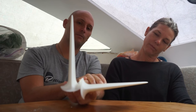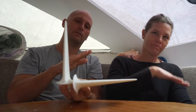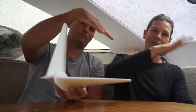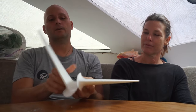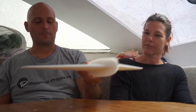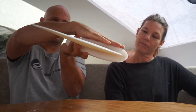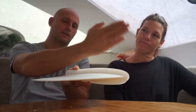The other bonus that we get — because we're only in a 40-foot cat, we're quite short — is we have a lot of pitching, where the boat hobby-horses: nose down, bum up. By having these horizontal winglets on here, as the boat pitches up and down, they aim to resist the pitching moment. As the bow wants to go up, you can see the angle of attack change, so it actually wants to lift the stern up. As the bow goes down, you can see the angle of attack change, so it pulls the stern down. So these follow and try to actually level the boat out and dampen that pitching moment.